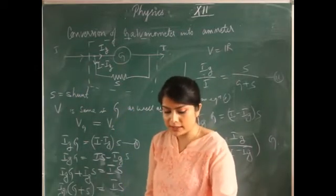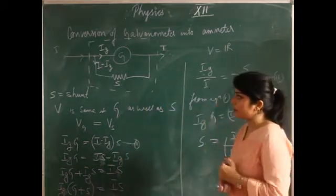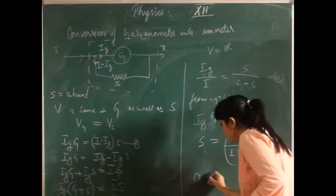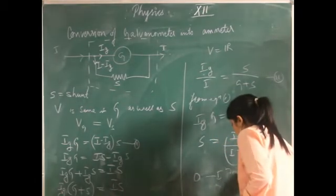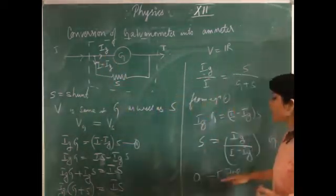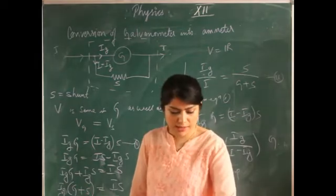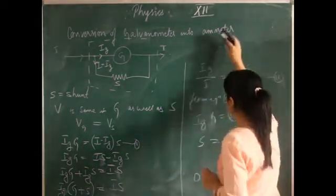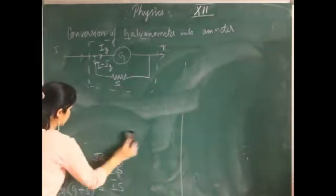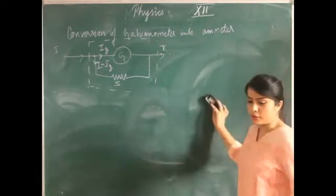What we can see from outside is that I is giving the deflection. Now, I'll give you a simple example to understand this better. What will be the range of an ammeter if we have current I over there? The range of the ammeter is from 0 to I ampere. It is actually 0 to Ig, but what we can see from outside is 0 to I ampere. This will be the range of the ammeter. Now next, I'll give you a simple example for a simple calculation. Remember this last equation, whatever I have written over here, that is required for the calculation.